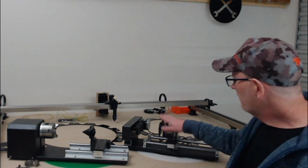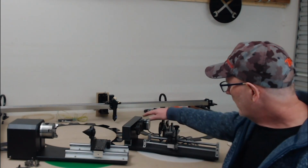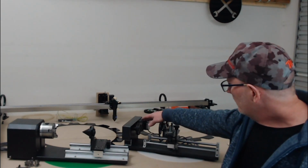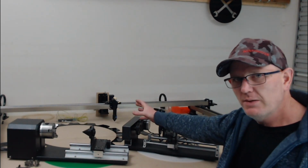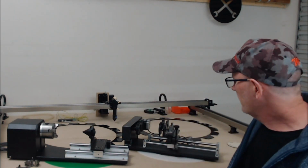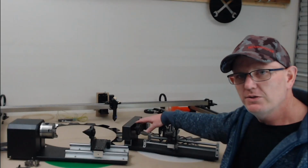If we compare that to the roller rotary, the roller rotary has a gear ratio on this one calculated at 1.5:1. That's not so hard, but we have the wheel ratio and the object diameter, and we then also need to find out the ratio between the wheel and the object for each different piece that we're using. Constantly doing calculations if you're changing different diametered objects.